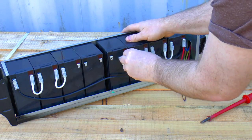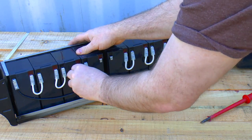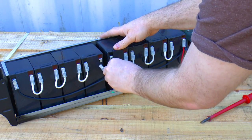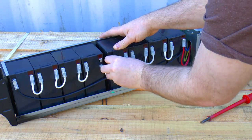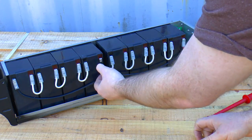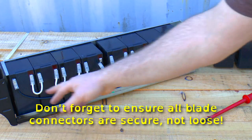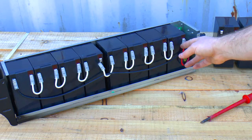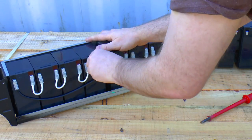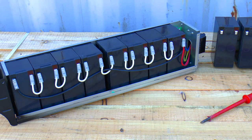Because if one did happen to have a connection to the side, it's only the last one that's going to be an issue. Before you do this last connection, make absolutely sure you've got everything right — remember that wire looped through there as well. We've got the black on the end, all the links through in series up to there. I haven't touched that end at all, so this should now clip in — and that battery string is electrically complete.